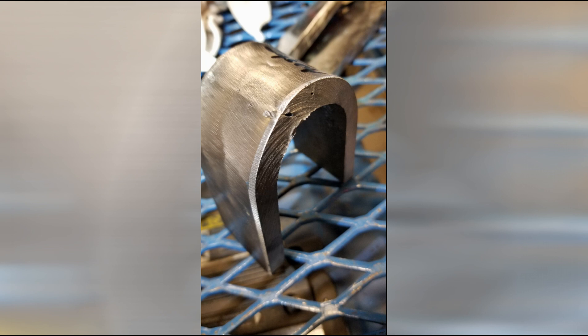There are a couple of small defects on the surface that can be seen. Looking at the root of this same plate, there is a defect longer than one-eighth of an inch — it measures almost a quarter of an inch. Near the tape measure on the far side, there is also another small defect near the three-inch mark. Both the root and the face would have to pass in order for the plate to pass.